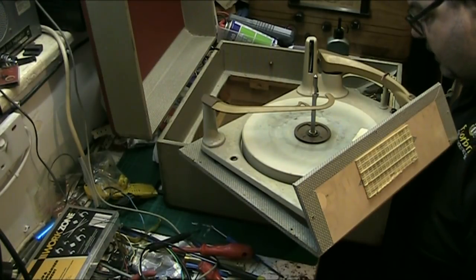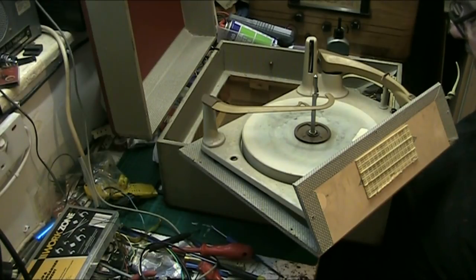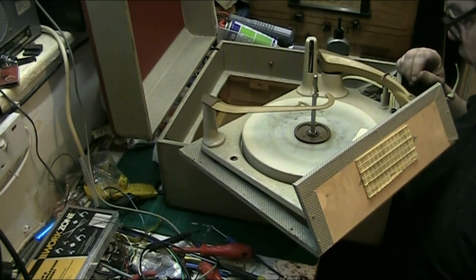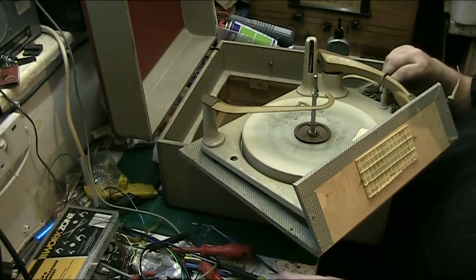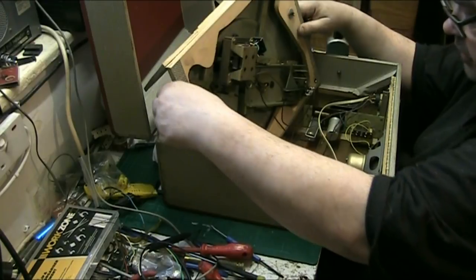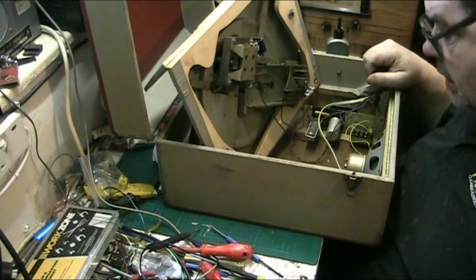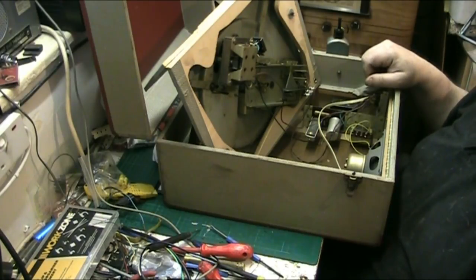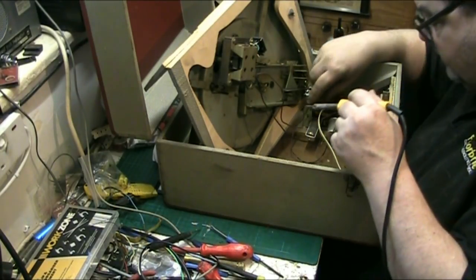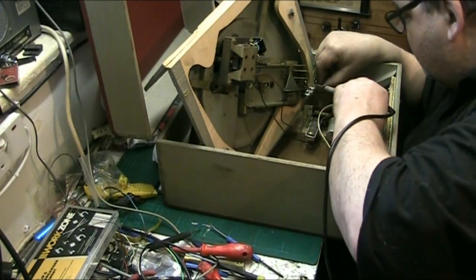It's got a metal rectifier. It's basically a very similar amp - it's the earlier amp to the one I've just repaired. The Tempo has the later amp in it; this is the early one, and it's got an unusual valve holder. If you're ever unsure how to gauge the age of a record player: the EL84 came out in 1954 or '55, so if it's an EL84 it's mid-'50s - not early '50s, because there were no EL84s back then.